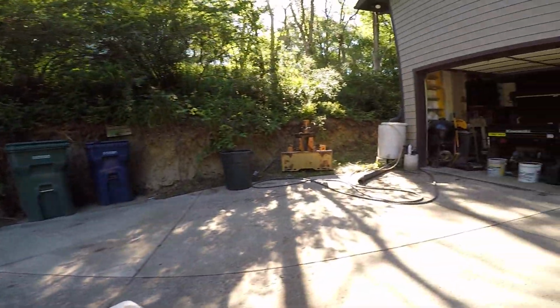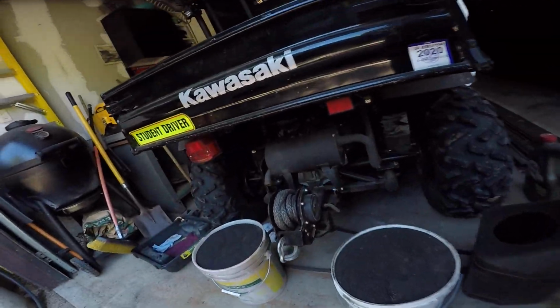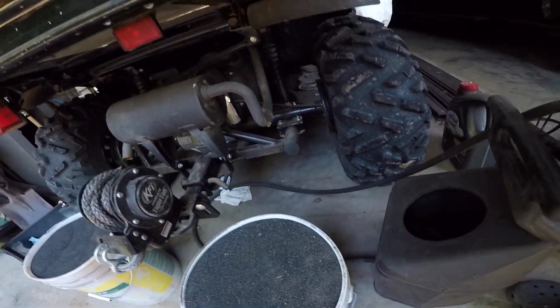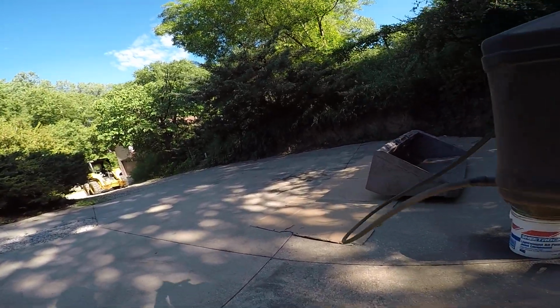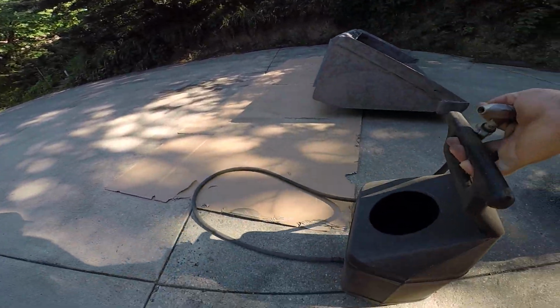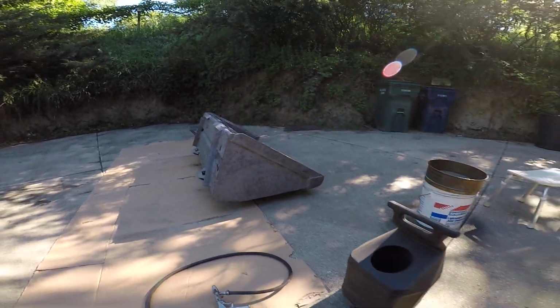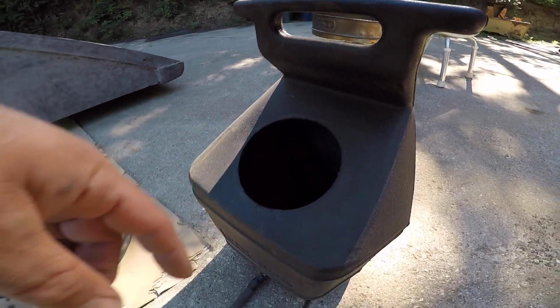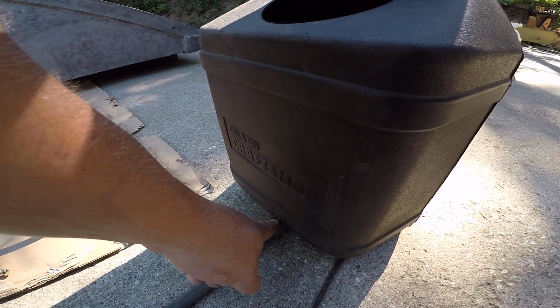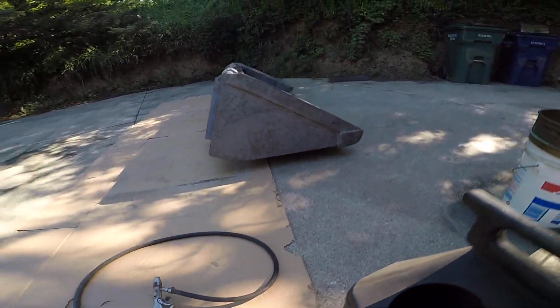Let's look at some of the equipment I'm using here. I bought this sandblaster about 20 years ago. There's this company that you kids may not be familiar with called Sears and Roebuck and Company. They've pretty much gone the way of the dinosaur. But it's the old siphon feed, so you put your abrasive bits in there. There's a little air port here. Put your compressed air in there. It creates a siphon and just sucks it and just blasts it.